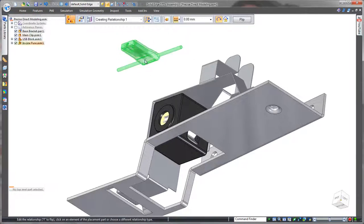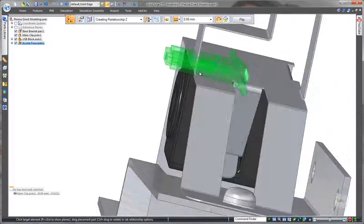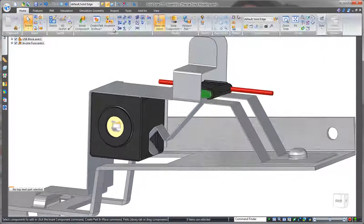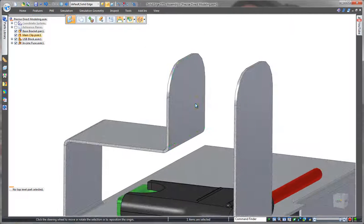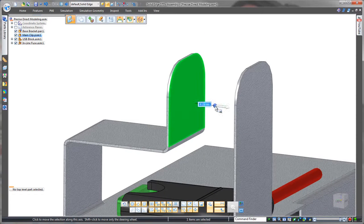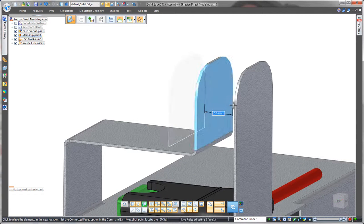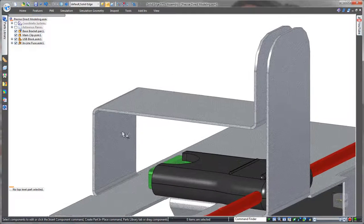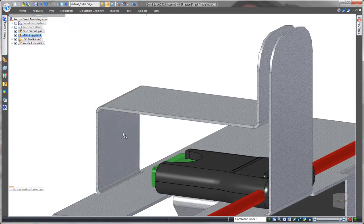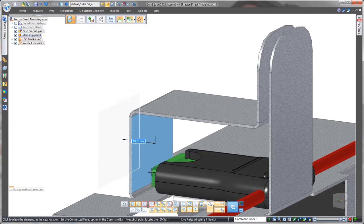The purpose of the top tabs are to support this, so we need to make sure it'll fit tightly into place. So let's make some more precise direct edits. Now I know the wire diameter is less than 3mm, so what we can do is drag the steering wheel to create a 3mm offset before dragging and snapping the tab itself. This leaves us with a 3mm gap, precisely how we want it. Let's drag this section in too, up against the fuse.